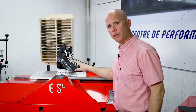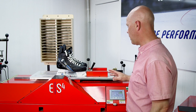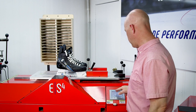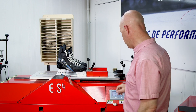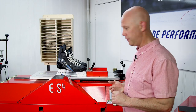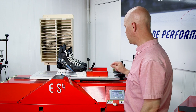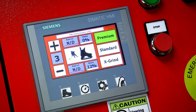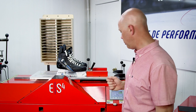We've discussed the wheels, we've loaded the skates onto the machine, perfectly centered and clamped. Now it's time to get into the sharpening process. We'll take a look at our user interface. All of our options are here — in this case it's a pair of hockey skates. You could obviously select goalie skates or figure skates as well. In this case we will select hockey skates. We'll do a pre-programmed amount of passes, in this case three. In the event that there was a particularly heavy nick on these skates, you could use either our cross grind function, or you could increase the number of passes.